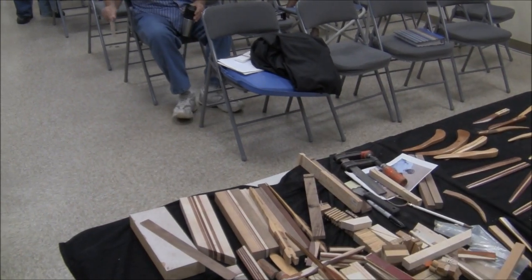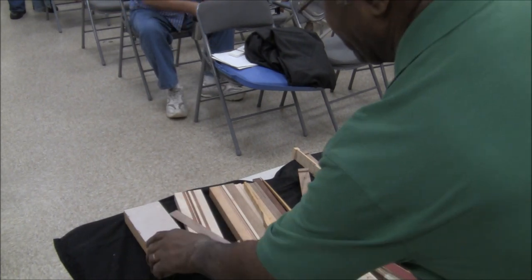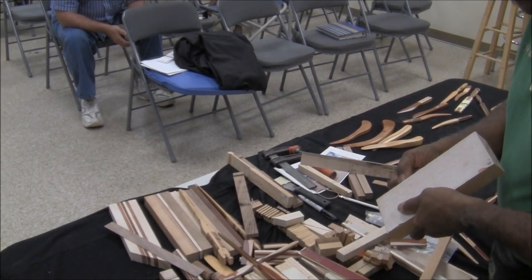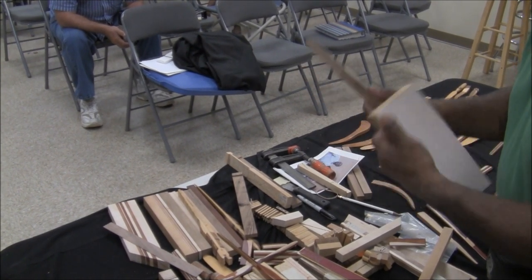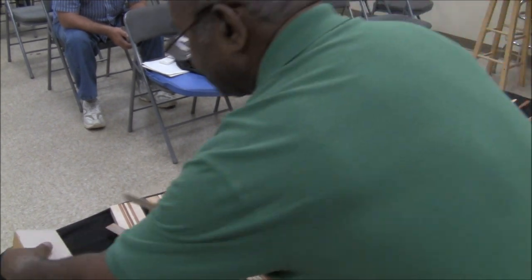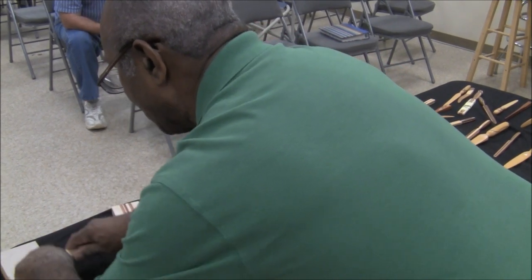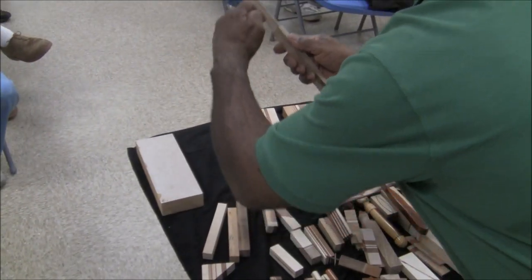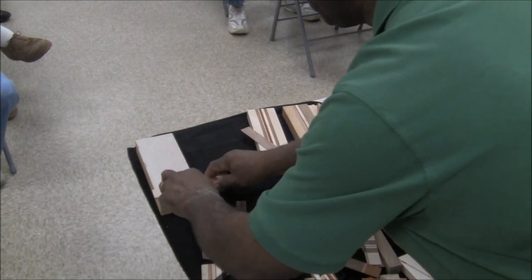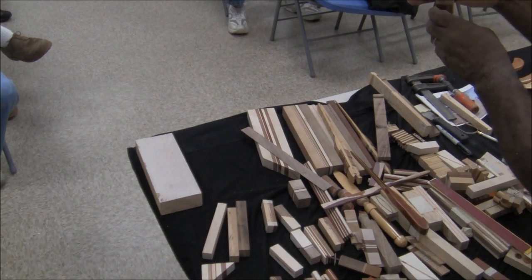All right. Once I get to this point, that sanding block I had, here it is. I put sandpaper on here, but I make sure that it's not exactly to the edge, it's right at the edge. Because what I want to do now is sand this whole thing flat. And the way I do that is this is stuck on my table and I can slide straight here. I want to keep this straight. I don't want to dig into this part. So by using a block like this, I can keep it straight and I can look at it.